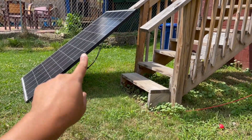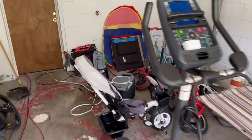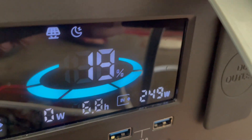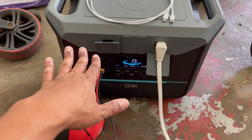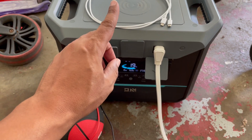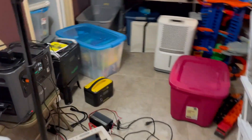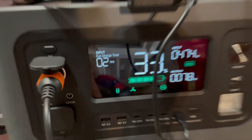That's ultimately why this panel is over here — my Renogy panel. Let's see what the Renogy is getting out of curiosity, because that one is on the Dura controller in MPPT — I don't really trust it, but it's been doing okay. Look at that — it's getting 259 watts. That's a 320-watt panel compared to a 290. These are in the same form factor, about 66 by 40 inches. The other is getting 257. Let's see what my EB20 is getting — 258 watts. So the controller is doing okay with that single panel, and this one's getting 475. This is going to be full in two hours.